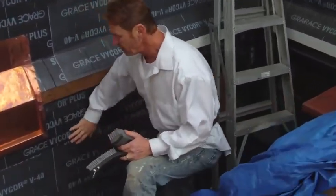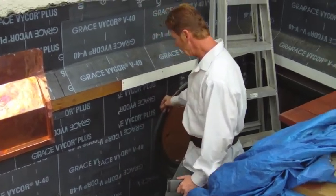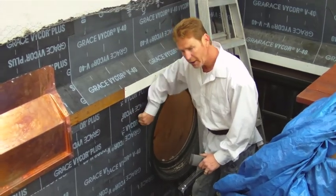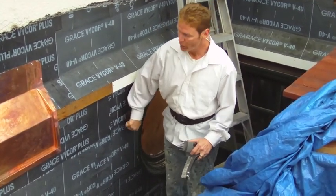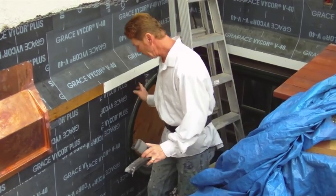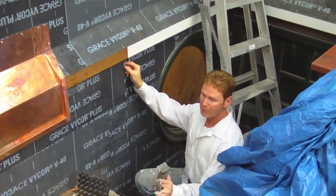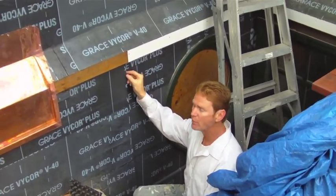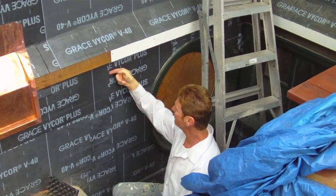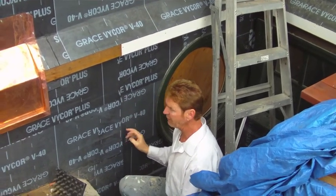This is concrete. When the grace membrane was applied, it was applied directly to the concrete. This part is wood — hear that: wood, then concrete. We decided might as well grace everything, so the grace has come over here. An important thing to remember when doing the grace membrane over concrete or wood is to get your corners tight. This corner comes in here because it doesn't roll — if it rolls, those rolls sometimes leak.